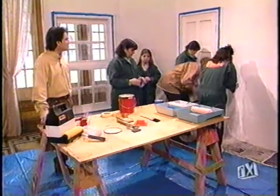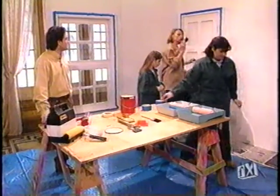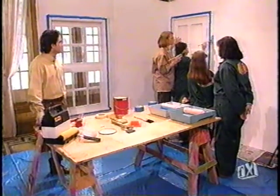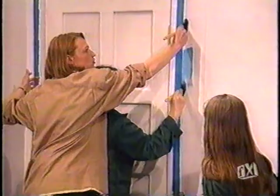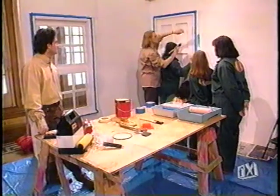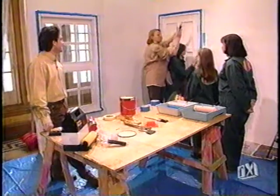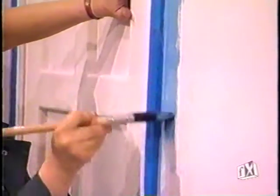Here's your paint, and what you're doing is called cutting. Cutting is working or outlining the area around your windows and doors. Let's turn that sideways — that's the cutting motion right there, you see that sideways angle? That's why it's called cutting, because you're trying to get away from the windows and doors. I've been painting for so long I don't use tape — I can cut around things, cutting around the windows and doors, because you're going to paint them either a different color or a different gloss.